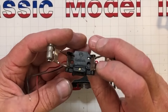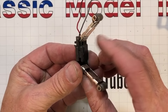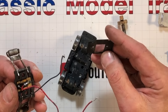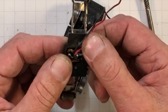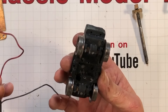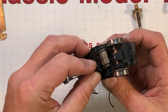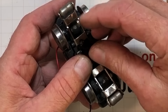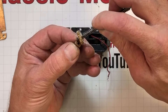Going down to these truck pickups — it's got two little fingers pushing down for this decoupler pickup. This is the front of the locomotive — the gear goes forward. It's got a shiny side and a non-shiny side — shiny side goes up. It's also got alignment pins and can really only go on one way. The gear goes towards the front and the black wire for the uncoupler will come up over here. Put the black wire through here and the red horn pickup through over here. Careful not to pinch any wires. The bolts with insulated washers go in here.